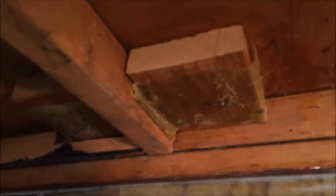They drill the holes. Half of the size of the board is the hole for the wires, and it looks like it is toenailed. It's not sitting on a shelf on the ends. It is definitely not sitting on a shelf at the end, and it's starting to sag a little bit. It does have blocks glued up. That's where the handrail upstairs screws down, so that's a good thing.